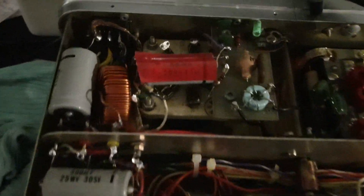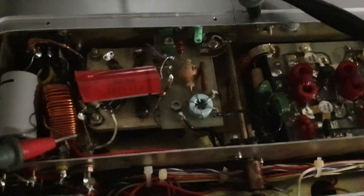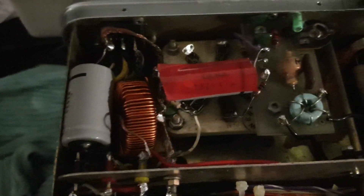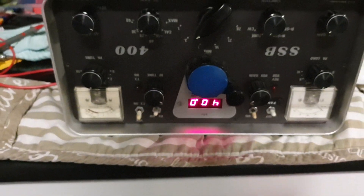The transmit test we wanted to do — we won't actually get into the PA stage. I have a rule that when we find something like this, if I don't know enough about what all the feeds are, we need to draw a little mud map before we go crazy into the output stage. This section has a 12-volt feed coming through, but we don't know enough about what the other feeds are.